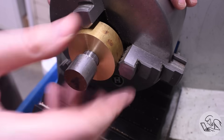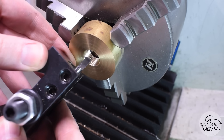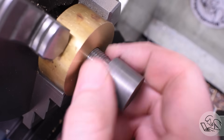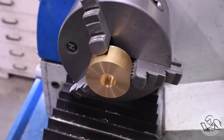There's really nothing quite so satisfying as a mating thread that you cut yourself. I really strongly encourage you to try this if you've never single-point cut threads on your lathe — there are few operations as satisfying and sophisticated yet done with such a simple tool. Once you've got confidence with a through bore thread, it's time to move on to a blind hole. This is a more challenging form of internal threading because there's a high chance of crashing, but this is also where single-point internal thread cutting really shines — you can do very shallow threads where you could never hope to get a tap to start. You might get one thread with a tap, but with single point thread cutting we can get lots of threads sufficient for whatever we need.